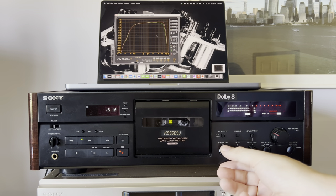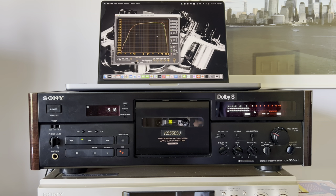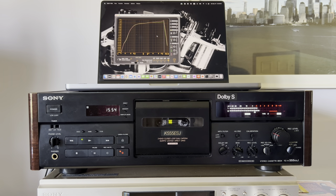Now switching to Dolby C — and that's where the differences start. Dolby C extends the signal at zero decibel level all the way to 20 kHz. This was a really interesting observation, considering we're recording at zero decibel level. I truly believe this is because of the capacitor replacement, because before I could always hear Dolby working. Now you see both left and right channels are better aligned, with a rise of about plus 1.5 dB at 16, 18, and 20 kHz, dropping only after 20 kHz — and still at zero level at 20 kHz.